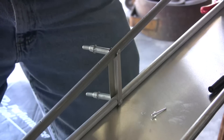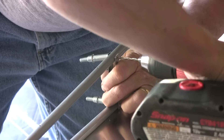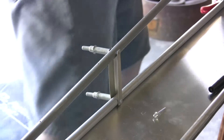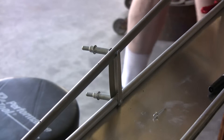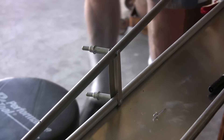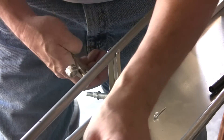At this point that is still a size 40 hole, so I have to go in now and open up that hole to the correct size. I had everything laid out except my deburring tool. You want to make sure that you deburr all of these edges before you pull your rivets. So I'm going to go ahead and drill these holes out and deburr them. I did do that on the bottom already, but I didn't do it on the top pieces yet.